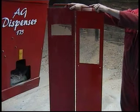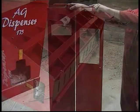We recommend small amounts are removed at intervals from the slide. Run and test regularly until the correct size is achieved. We advise holes are enlarged towards each other. Ensure safety clothing is worn at all times.